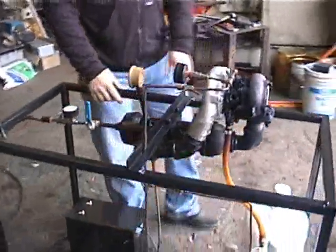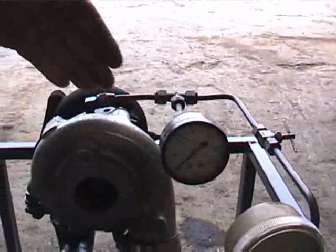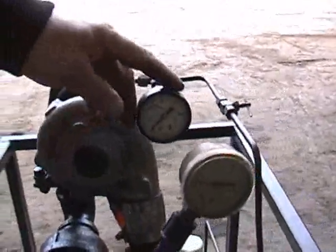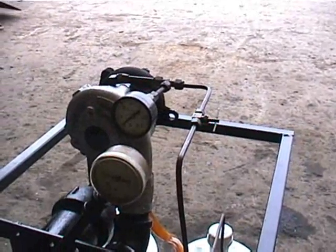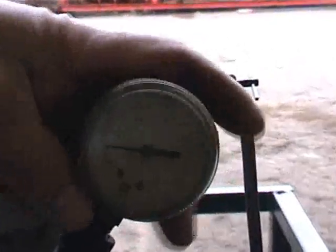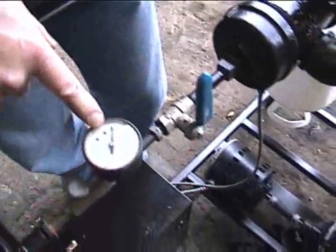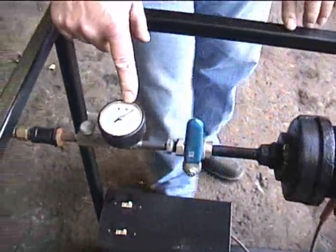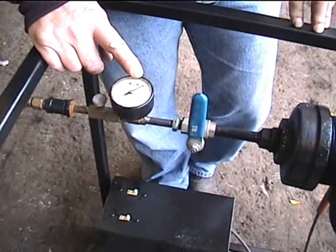Just to point out my instrumentation — it's pretty basic. Here I have oil pressure, which is right at the inlet to the bearing of the turbocharger. That's a fairly important one because I do reduce it a little bit for ease of starting and then increase it as we spool up. This gauge is just to measure combustor pressures; it's on a long extension so I can keep the heat away from the gauge. And here we just have fuel pressure, which is a fairly important one to monitor — it basically directly relates to how fast the engine runs.